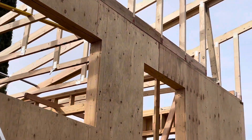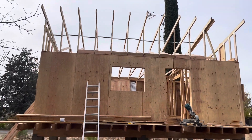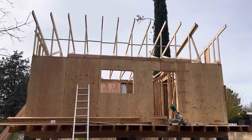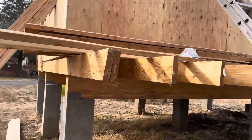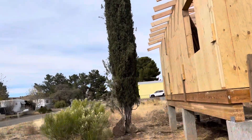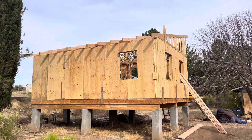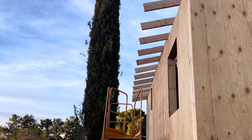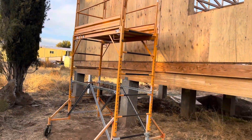That's it for now. This is what it's looking like from the front — the kitchen window and the door. True tiny house. Try to keep the balcony for the front entrance. That's all the pillars and columns. Check out that slope — that one and a half per foot. A 16-foot run leaves you with about two foot in the front. I got my buddy's scaffolding, so I snapped a line on the tails.